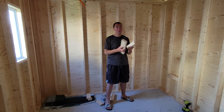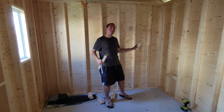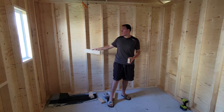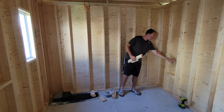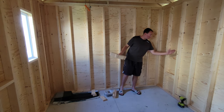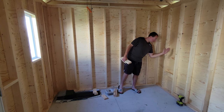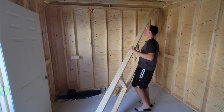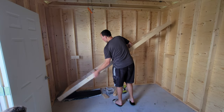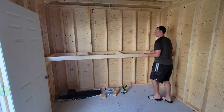So here we are inside the shed. I've got some blocking and bracing we need to install. We're going to put two temporary blocks along the back to support the back of the shelf when we go to put it in place. I've already got marked out my height — 44 inches off the ground, whatever height you'd like. Over here on the side is the brace where we made that front rail extra long to go inside here, because the front of the shelf isn't going to rest exactly on a stud — that's the reason we're doing this, so it'll rest directly on that brace and be totally supportive and super strong.